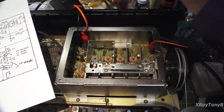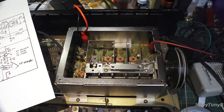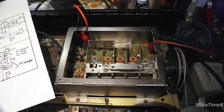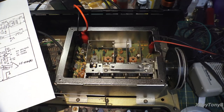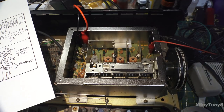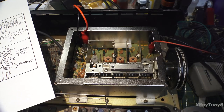This is going out to the input of the spectrum analyzer and this is coming from the tracking generator. First thing you need to understand: I do not have this perfectly coupled. The spectrum analyzer is 50 ohm and you can switch it to 75 ohm — mine is capable of that. I just didn't do it because I'm not really concerned about levels or amplitudes. We're not measuring amplitudes; I'm not going to get crazy with impedance matching. Because we have capacitances introduced and the cover is off, you're going to see some noise or distorted waveforms from what's really going on when everything's all sealed up.